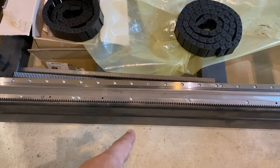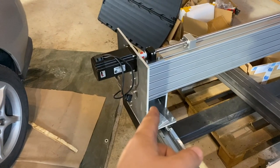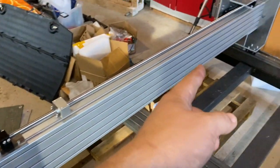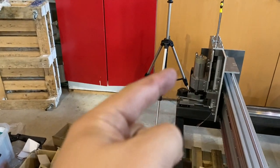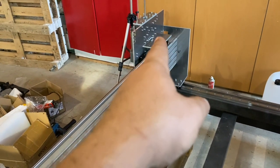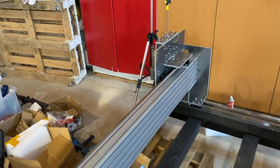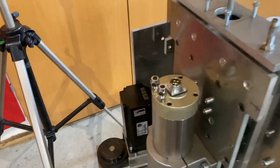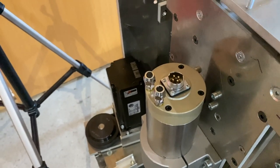Powering in spot will be kind of in the middle here. So every cable will go right here through that chain into here, and there it will split to this motor and that motor, and one cable will go maybe through the profile or behind it somewhere to that motor on the other end. And then of course with the chain it will supply power for the Z-axis motor and the spindle itself, and there also will be those cooling lines which you can see over there. So there's a cable going and then the water coolant back and forth. Yeah, that's about it.